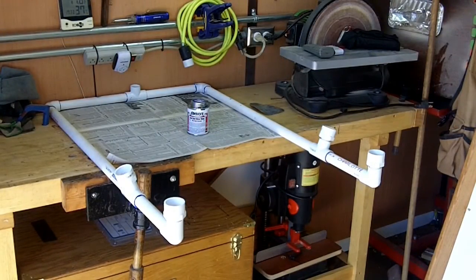Okay YouTube, I've got the frame all glued up and ready to put the rod holder extensions on. If you're going to be doing this, I'll give you one little hint. I used that Christy's Red Hot Blue Glue — it says Dry Fast and it's almost instant setting. So when you put the pipes together, make sure that they're lined up right, because if you wait just a couple of seconds you're not going to turn them. Which I found out and had to go back to Lowe's and get a couple more elbows and a T.